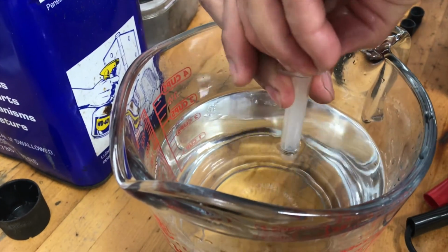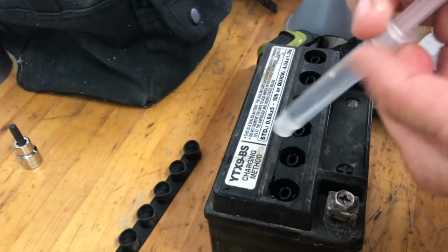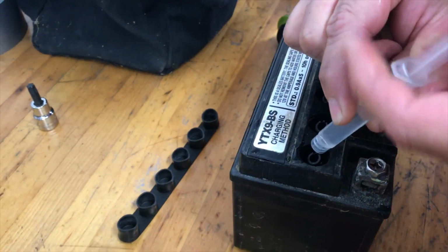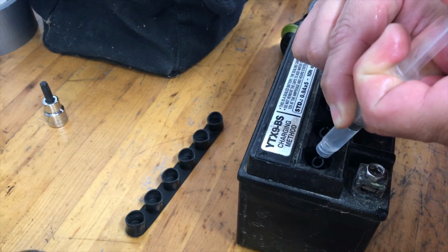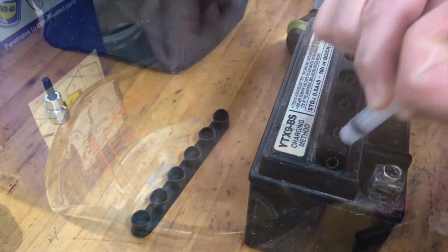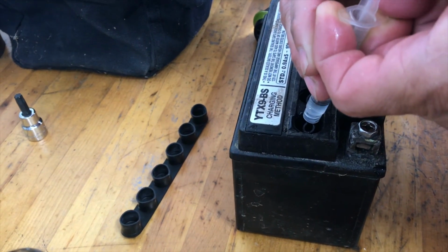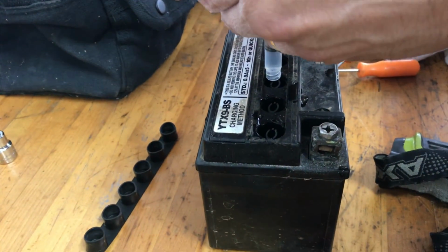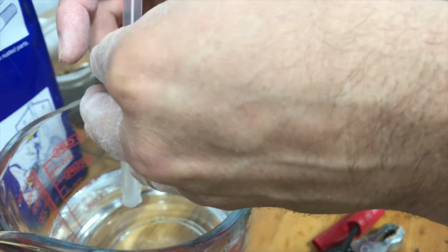I don't think the salts are going to hurt the battery, but having no water in the battery definitely hurts the battery. Now, if any of you guys out there truly have had luck with these salts in recovering batteries, please comment below. Now, I have read patents about this sodium sulfate being able to extend the life of a battery, but I have certainly not been able to recover one with these salts.